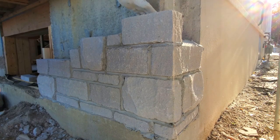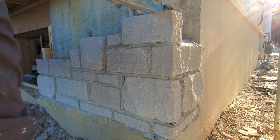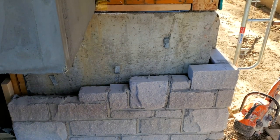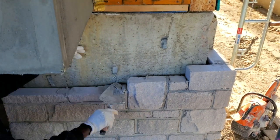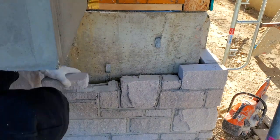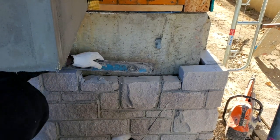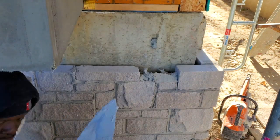The most important thing you need to know as a stonemason or as a beginner is to understand the three-rule of how to lay stone. The most important thing: don't go no higher than the biggest size stone you have — in my case the jumbo stone is the highest. Once you reach up to the jumbo stone, you have to put one across and break it. Also, you don't want your bed joint to be no longer than four feet.